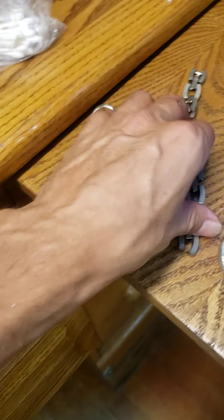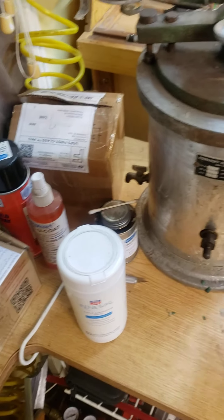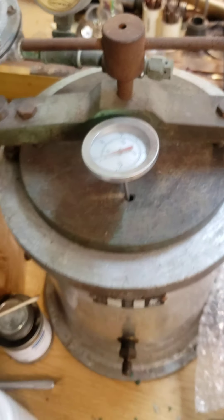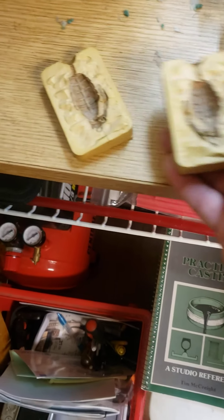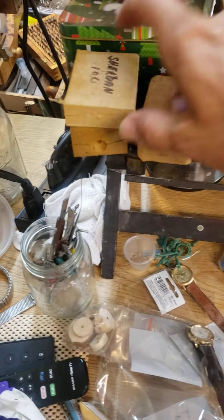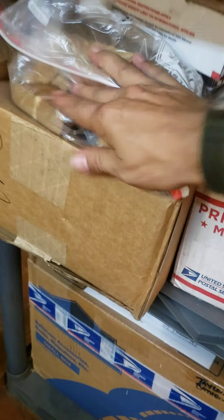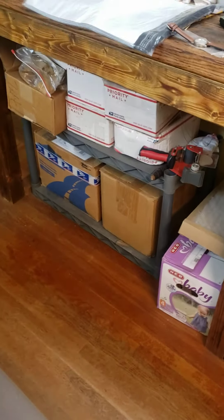Here's some of the bracelets that I can do — I can cast in-house. This is a Romanoff wax injection system, full of wax. It heats up and I've got pressure going to it with the compressor running at about 4 PSI, with a temperature gauge to make sure the wax is melted before injections. Basically you use molds like this — this one is a grenade. I've got about a thousand rubber molds and probably another 4,000 waxes — ladies' earrings, pendants, gents' rings. You can cast in silver, gold, brass, bronze — any metal really.